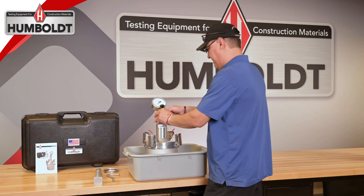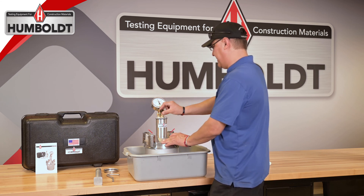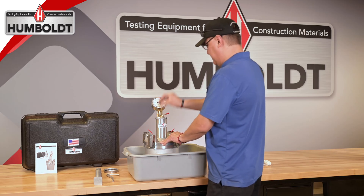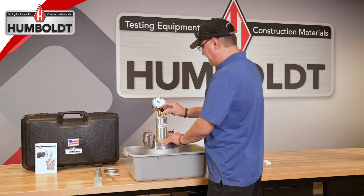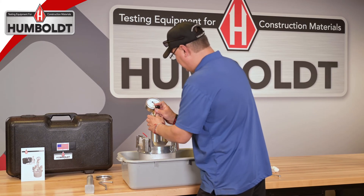Once completed and without closing the pet cocks, use the pump to increase the pressure on the dial gauge to match the predetermined initial pressure reading. The initial pressure reading, or IP, is indicated to the left of the center of the dial, at the percent air markings at the five o'clock position on the gauge.